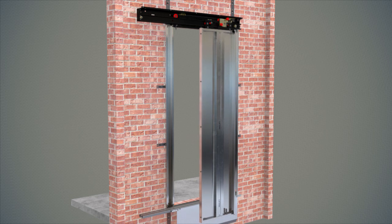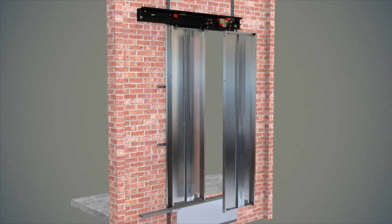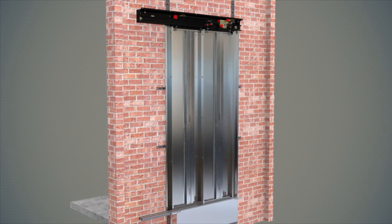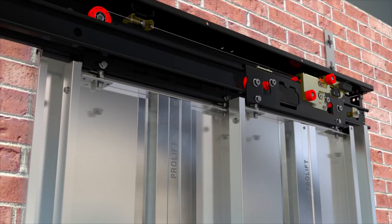The holes at the head sections of door panels are aligned perpendicular to correspond with panel suspension points. Panel suspension fine adjustments are made at level. The assembly of panels on the panel suspension is then completed by screwing washer head hexagon head metric 10 nuts.